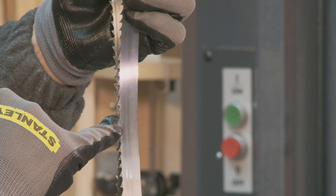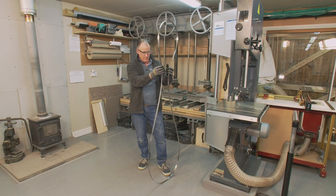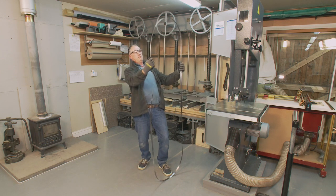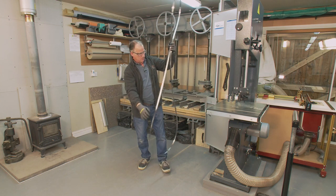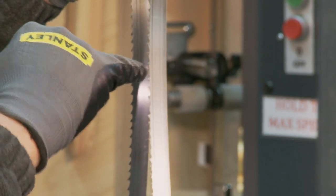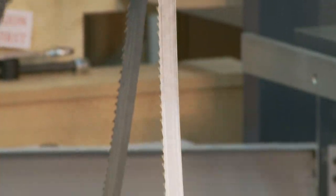This has opened up the correct way round — the teeth are on the downward pull of the blade, which is correct for cutting. There's a 50-50 chance it actually uncoils the wrong way. Let me turn this inside out — this can happen quite easily. Let me flip this over as well. Now the teeth are upside down; that won't cut, it will just burn and rub through your timber.